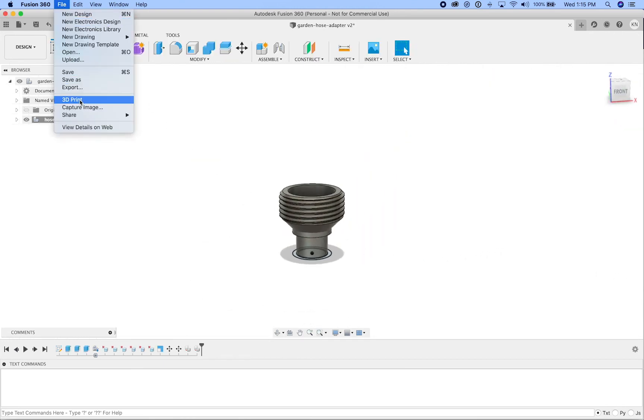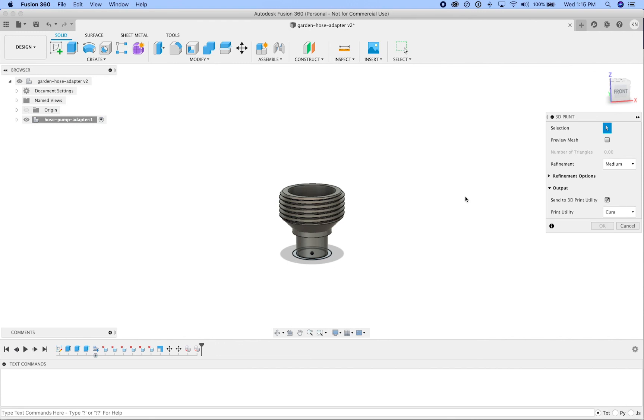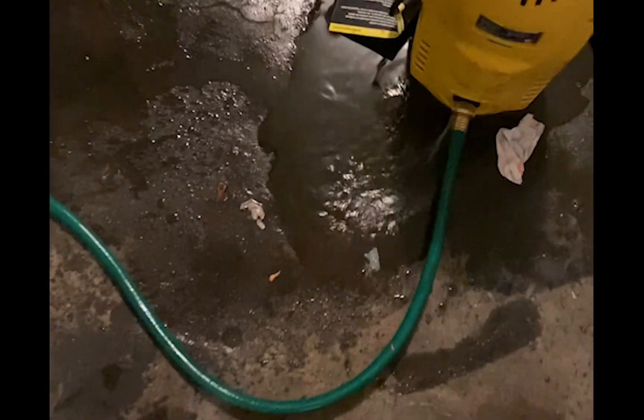That seems to be functioning in its entirety. I just need to iterate so it doesn't come out too easily — and that's really easy to do. I'll go back into Fusion 360, go back to my original sketch, zoom in to this line, edit it to 13 millimeters, finish the sketch, and it's ready for 3D printing. That's all there is to it. Let's see how it works — pump to adapter, coming over here, and pumping into the power washer.